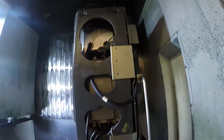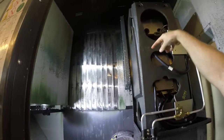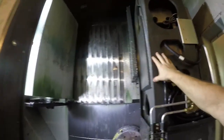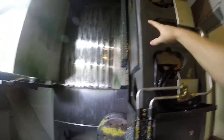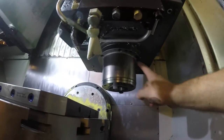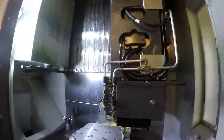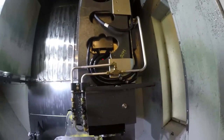We now have a look at basically everything. Ultimately we're going to be working on the bottom and the top a little bit. From the top we're going to take off the fan. We're going to take off that black plate so that we can undo four bolts that hold the motor to the spindle frame. Then we're going to go down here and undo these six bolts, and the spindle literally just drops out. We also have to deal with the air line right there — that's easy to take off. I think it's like a 10-millimeter push-to-connect hose, and that is for air and oil to the spindle.